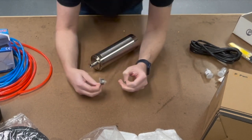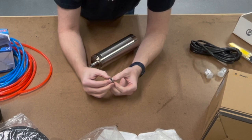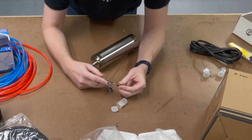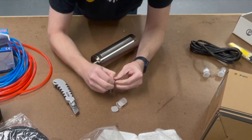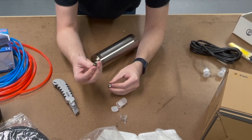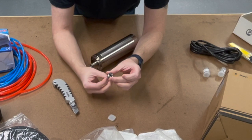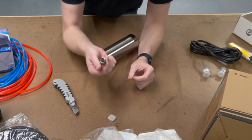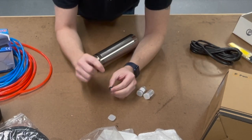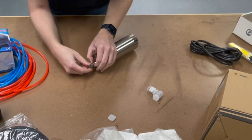We've got a nice silver spindle nut on there. What you're going to do is take your collet — let's grab the quarter-inch collet — and press it into the nut so they snap into place. That snap lets you know it's held on to the collet, and the collet should not fall out inside the nut. This is why a lot of people order extra nuts: so they can pre-load additional collets, put a bit in, set it aside, wait until the bit change comes along, and then just unscrew one and screw the next one on.